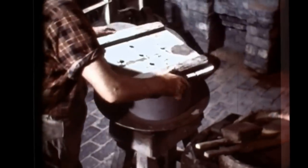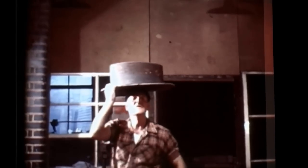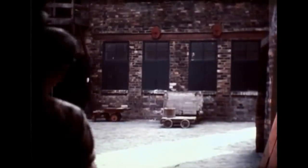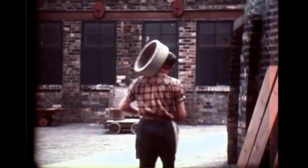The piece of wood I'm using to banner the top of the sagger with is just to show that the top of the sagger is level. After it's bannered and you've lifted it on the head, then you take it into the hovels to dry. My last job is, when they are dry, to take them out to the sagger house for the placers to use. I wish I had got a pound for every sagger I had made, because I have done forty-seven years at it.